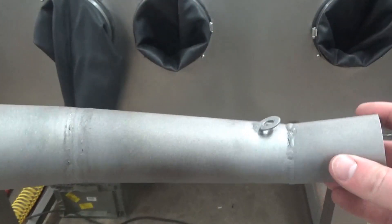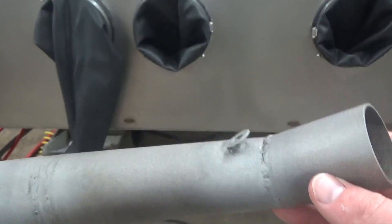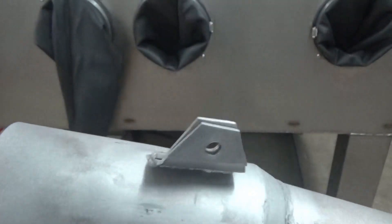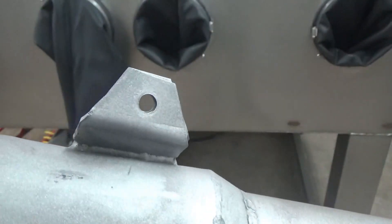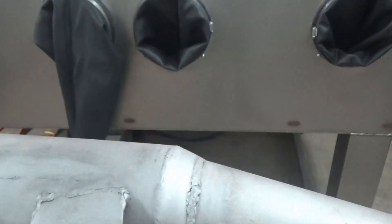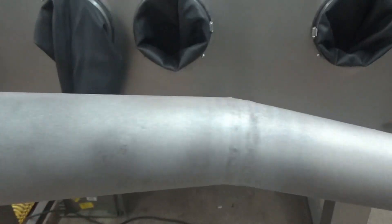Okay guys, back after rinsing and drying this part off. What you can see here is a very, very clean part. Where wet blasting really excels is in these hard-to-reach pits and areas — this is where sandblasting really falls short. In these deep little grooves, cuts, nooks and crannies, wet blasting really flows across that surface and gets into those deep, tight spaces. You can see how clean this part is.